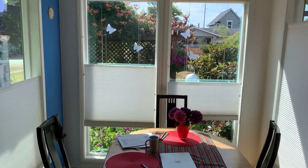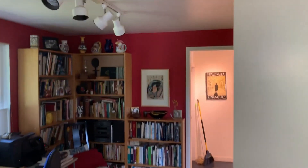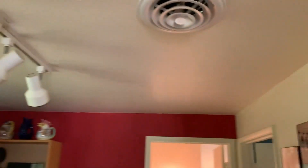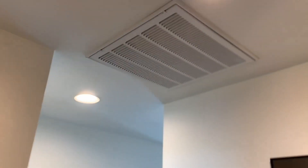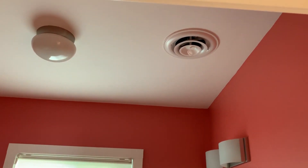The space is really nice and open, so this unit is going to heat and cool this room beautifully. Moving on, here's our first glimpse of the ducted ductless system in the attic. We have a diffuser in the ceiling for the study, and in the hallway we have a 20-by-20 return air with a two-inch filter. In the bathroom we've got a six-inch adjustable round diffuser.